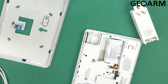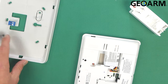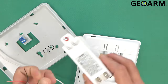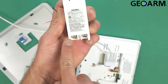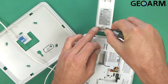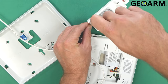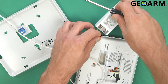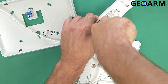Now we'll go ahead and get it wired for power. You're going to be taking your two leads, the black and the red lead. Red I usually use for positive power, black for negative. Our power supply is a DC power supply, meaning it does have polarity. So we're going to go ahead and get the red wire wired to DC positive, sliding that red wire underneath and tightening it. Then take the black wire to DC minus or DC negative, get that tightened down in place. Now that power supply is wired and ready.